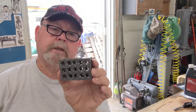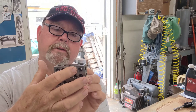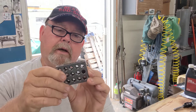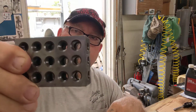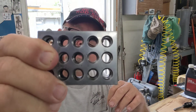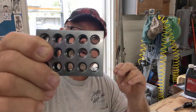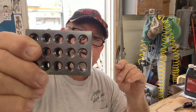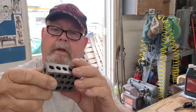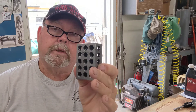Right now I'm asking for some help because these holes that are threaded are 3/8 and they're 18 thread. I'm trying to find out if these are Brown & Sharpe, which always used 16 thread, and also Starrett. But they're 3/8-18 holes. They look a lot better than when I got them.